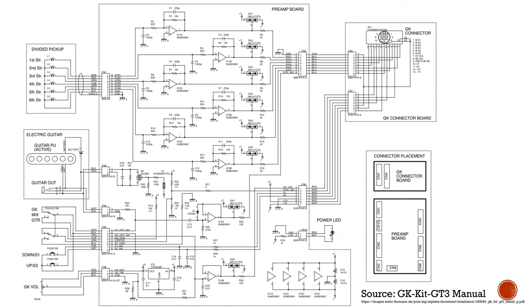To do so, I just bought a GK3 kit — a used one because I didn't know which of the channels I would really need. This GK3 kit is normally meant to be built into a guitar to upgrade a standard guitar to a MIDI guitar. To understand how to connect the different channels, I looked into the circuit diagram in the manual of this GK3 kit. You can see that each of the strings as well as the composite input all have individual pre-amp circuits, and on the other part of the page you can see the creation of the signals for synth volume, selection mode, and the connection of buttons for select 1 and select 2.